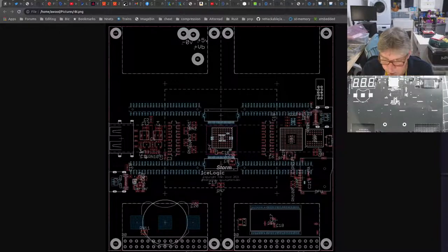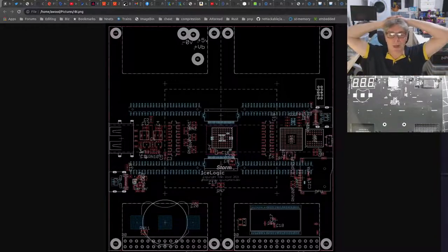Do you have UART pins from the STM to the ICE 40? No, we don't have UART pins between them. But as I said, we've got the SPI pins, so it's best to just do the UART over those. It's full duplex. If you're in a MicroPython or CircuitPython environment, then you can quite easily switch modes between the SPI and the UART. I've overlapped RX and TX with the clock and select pins, so it's possible to enable one peripheral and disable the other.